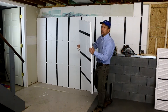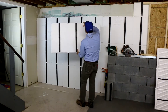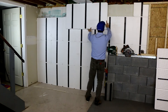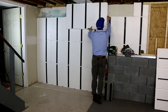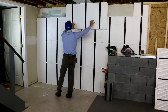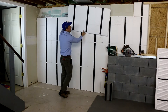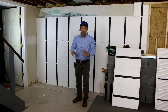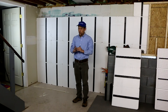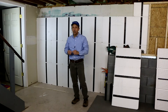I am not that ambitious. So the way I would do it is I would hold this upside down and face it this way, get it nice and level, and then see where my mark is. Now my mark on this particular panel — we're marking right to the top of that tongue, right about there. This isn't rocket science. We just need to get it close. InsoFast is rough carpentry, not finished carpentry. It doesn't have to be perfect. We have to make sure it's flat and level, and it doesn't have to be beautiful. It's just, after all, insulation and framing.